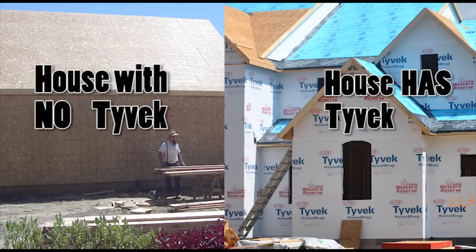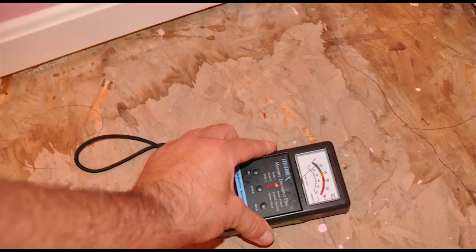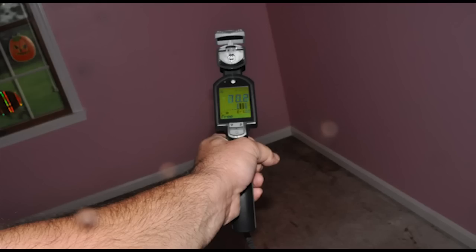During the water leak investigation, T and I performed initial moisture testing, took photos of old moisture stains of the dining room floor and of the basement joist pockets that existed below this moist floor area. This was done to create a baseline to see if anything would change after water testing. We tested the wall surface temperatures and indoor humidity to determine if wall condensation conditions might be occurring. They were not.